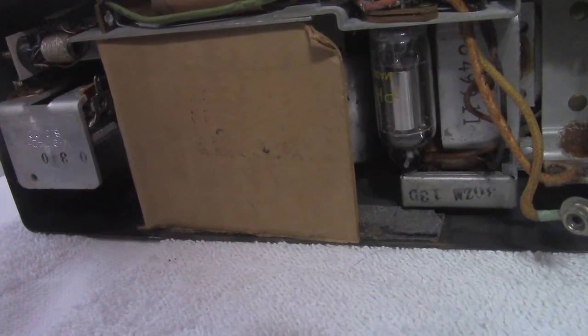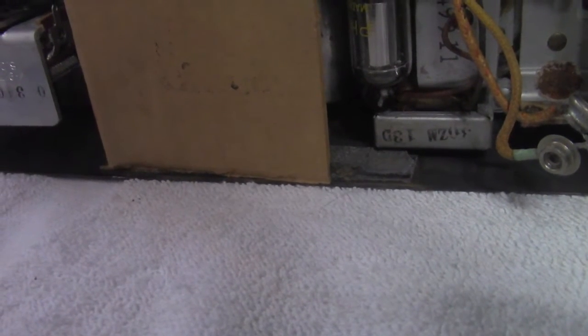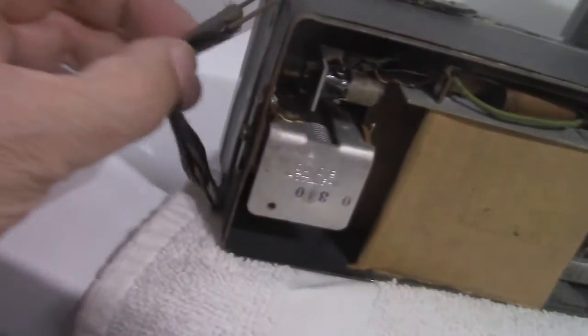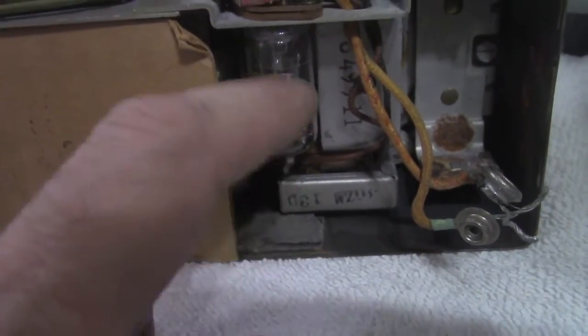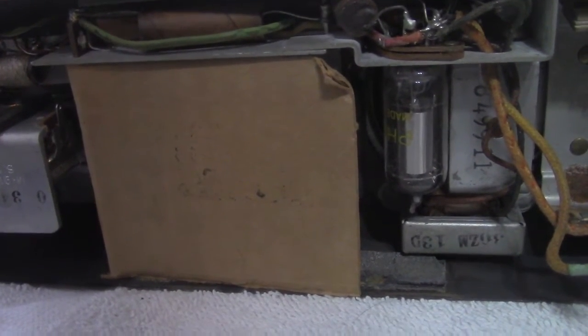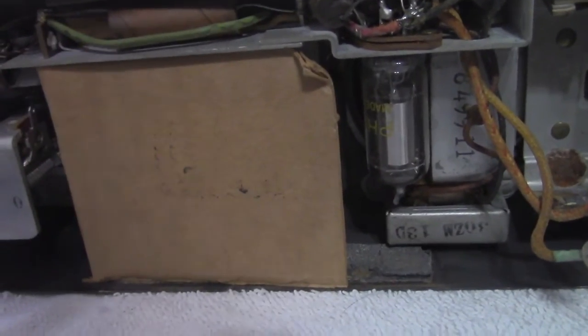It has the 1S4, the 1S5, the 1T4, and I think a 3Q4 — I can't remember right off the bat. Anyway, it's just a basic little set. It even has a little carrying handle. This is about as small as vacuum tube radios can conventionally get. Now there are some smaller, more miniature tubes, like the little pencil tubes, but this is probably one of the smallest commercial sets available. It flopped for a number of reasons — probably because this battery was almost proprietary. I think it was an Eveready Mighty Midget battery or something; it was pretty much just made for this set. It's like 67 volts.